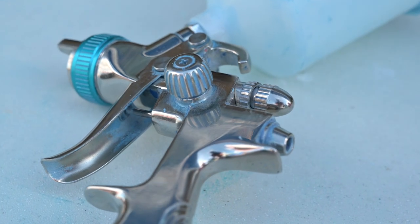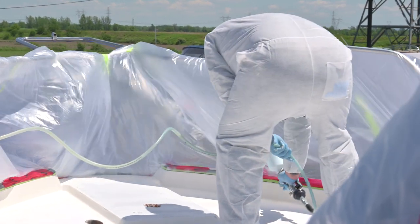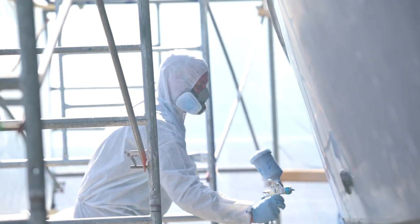Up here is your fan pattern — open it to the max and then close it down just a little bit, and you'll see the fan pattern creates an oval. Then adjust how much paint is coming out of the gun with the other adjuster. You want to hold the gun pressed in for a two-count, seven inches away from your object, and that two-count will not produce any drips. If there are drips, you've got too much product coming out. Always keep it equal back and forth, giving a little feather at the end so there's not too much product overlap.